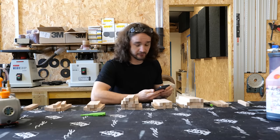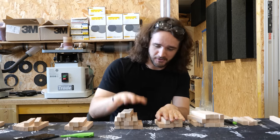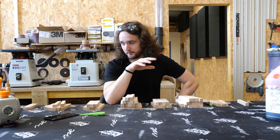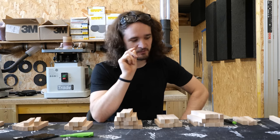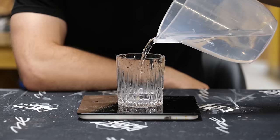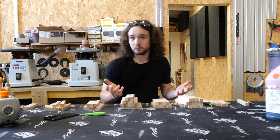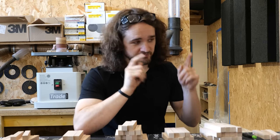The average is 35.65 grams across this whole range — the 35 pile and the 36 — so it's pretty much bang on. 35.65 grams is the average weight of the blank before stabilization. However, before we get to the stabilizing process we actually need to make them lighter, because within this wood is a load of water, and the stabilizing resin doesn't like it when the material still has water in it.